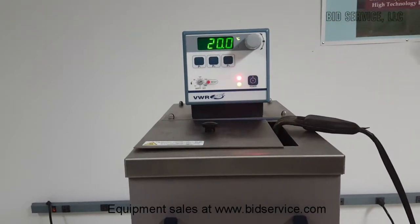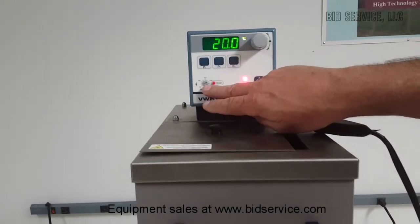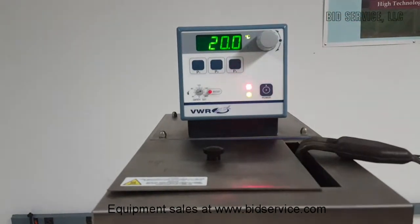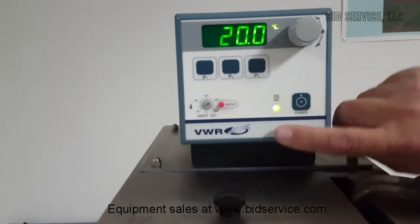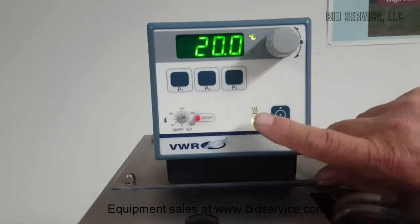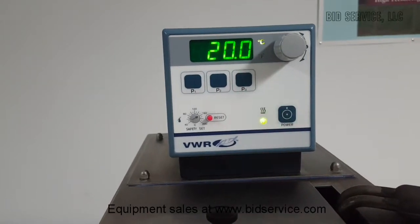So it's a good little protection so nobody changes it inadvertently. Your over-temperature protect is here, and if it does happen to trip, your reset is here. This is your indicator for heating and cooling. So we're at 20 degrees, so right now the refrigeration is on and our heating is pulsing, and it's doing that to be able to control at 20 degrees.